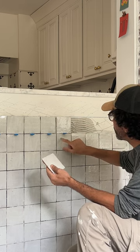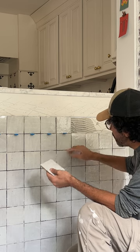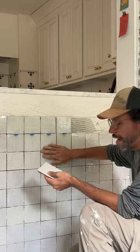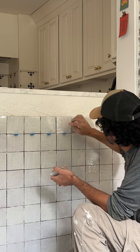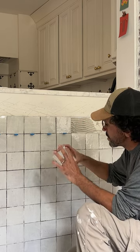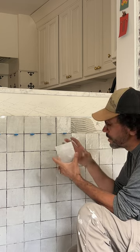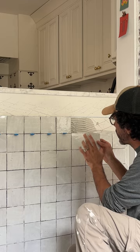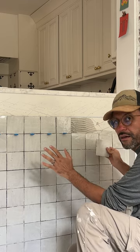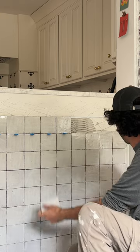This is handmade and it will eventually look slightly off, but you have to do your best to make sure it's even. Again, a 1/8 inch gap will help keep the lines straight, and the grout will merge it all together. Here you can see a little gap here and there because the tile is hand-cut — it's not going to be exactly 4x4, and the thickness might also vary. Do your best to keep it straight, and when you look at the whole thing, some off edges are totally fine. Thanks again and we'll talk soon for another tip and trick.